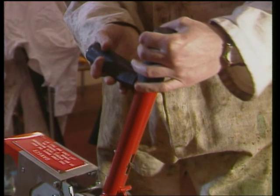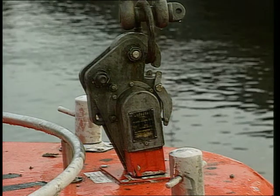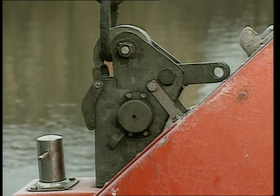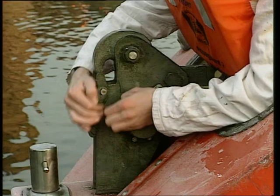Faulty procedures during drills include avoiding using the release gear altogether and detaching the lower falls link manually. This means that the release gear is never test-operated at all. Failure to reset the equipment away from the ship before reconnecting the falls. Failure to appreciate the significance of resistance in operation.